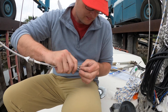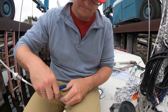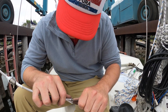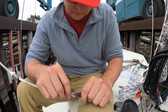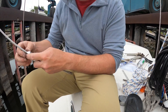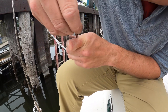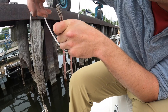That is very precise — you've actually been measuring it. It's kind of important; it says one-eighth of an inch. It's the rig. Bring it back down, and then you want to get the wires evenly spread around the ferrule, except for that notch in the ferrule. You do not want a wire to fall inside of it because then it won't compress quite properly. Just pop it out and reposition it.